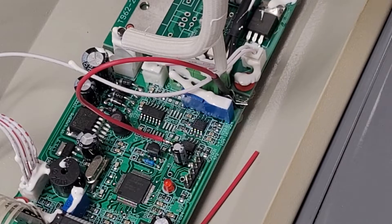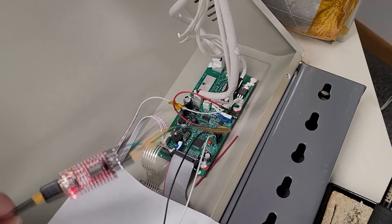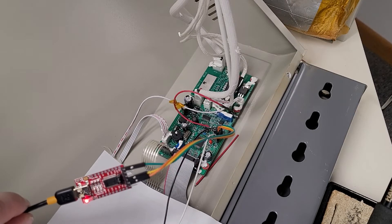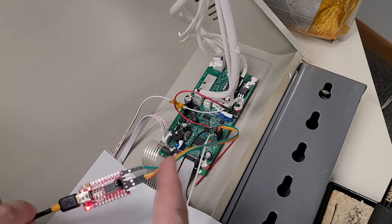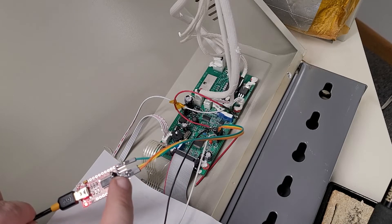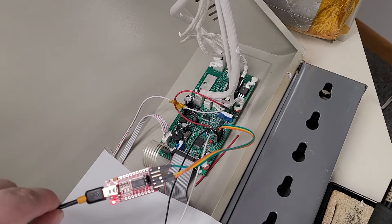I need to take and secure the sensor, maybe with some silicone or some Kapton tape, and make sure I secure this wire. Then we'll work on the firmware upgrade. Here I am getting ready to program the firmware. I'm going to leave a link in the description to the wiki I used. You have your connections to your ISP programmer — RX, TX, and ground — just make sure you reverse them when you come to your serial programmer. This is just an off-the-shelf Amazon FTDI programmer. I have Flash Magic on the laptop and I'm using the settings from the wiki.